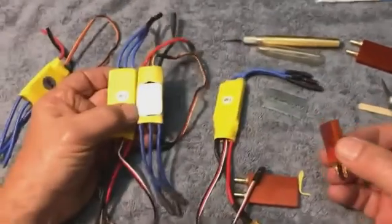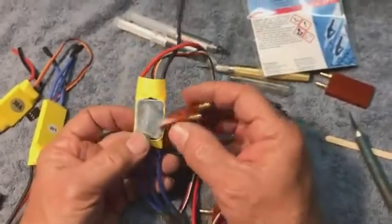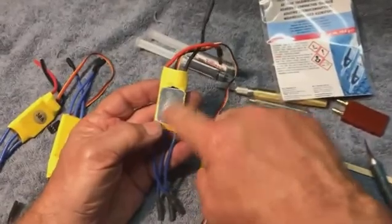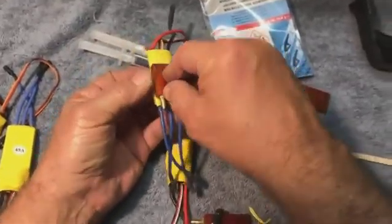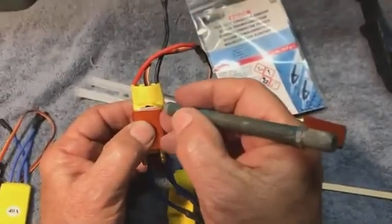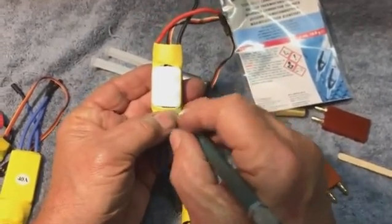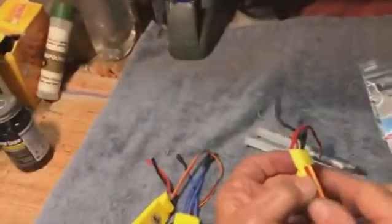What we're going to do is amplify that heat sink. You need some thermally conductive adhesive — this is an epoxy that you'll mix up. I use this as a mixing board right here. Mix up some epoxy and epoxy that down right there. Now you see what happened here — we've got a couple of little openings here in the shrink tube, between the shrink tube and the plate. Don't worry about that, we're going to fix that later. So this gets glued down here.